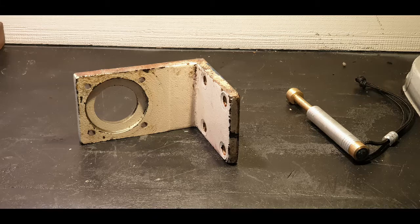As you can see in this diagram, this is the original L-shaped bracket removed from the motor. I had to pick up the old centres for fitting to the lathe bed and then fabricate a new face mounting. The type of motor mounting required — and what is supplied with this motor — is a B34, which bolts straight onto the face. So I had to fabricate a new face plate, weld it all up, and then fit it onto the lathe.